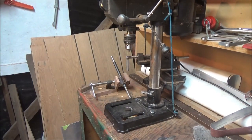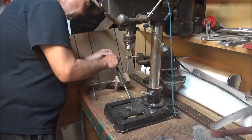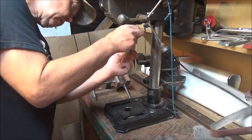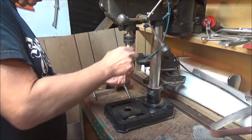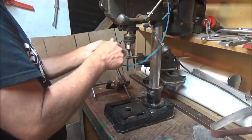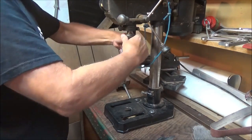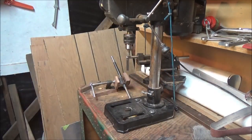Get rid of the stone and find a rubber bit that's spinning as concentric as possible. It's just rubber — it's just to clean it up a little bit. It doesn't have to be perfect because it's not cutting into the metal, it's just smoothing the edges out. Try a few options — you want one that fits well. Tighten all three chuck holes evenly on this too.